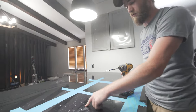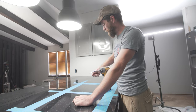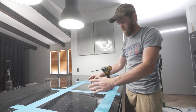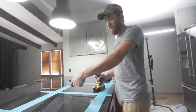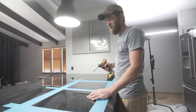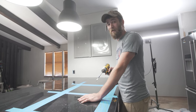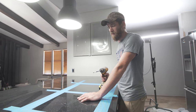I like to put one hole kind of in the middle, so that when I get to the end with the jigsaw, the whole countertop doesn't just drop out and crush whatever's underneath. The hole is to hold on with. The hole will be for me to stick my finger into and just hang on to the countertop so it doesn't drop, smash everything and scratch up the inside of the counter. We could do a three-hole, like a bowling ball grip. That way we get a super grip on it. That would be so cool.